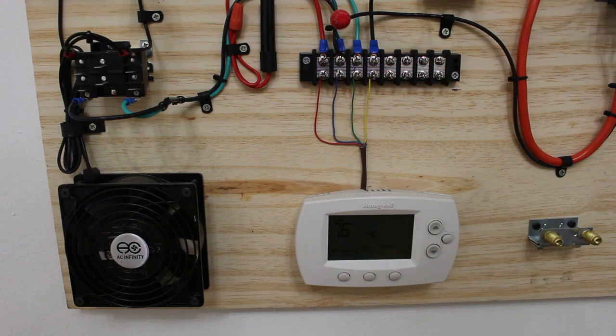Things can get tricky and confusing but once you get the hang of it, it's just like tying your shoes. With this demonstration we know what to expect in which scenario — where we should or shouldn't have voltage. With that we can focus on troubleshooting the rest of the system and eliminate the relay as our suspect. If we know our coil is energized, we have the proper voltage, and we're opening and closing our contacts with the proper voltage coming out of the relay — we now know it has nothing to do with the relay. Our control circuit is working, and then we will look into the component that's not operating — maybe it's the fan motor, and that's going to be another lesson.